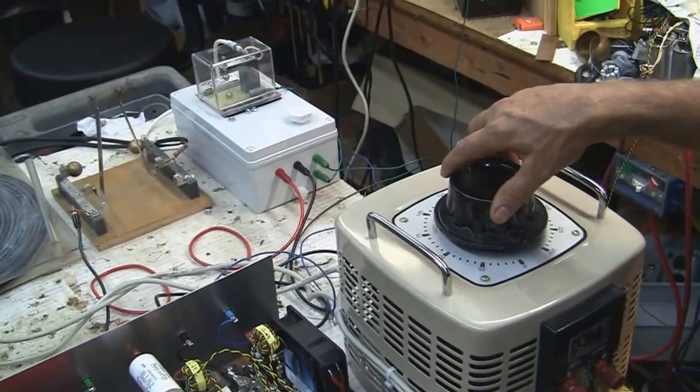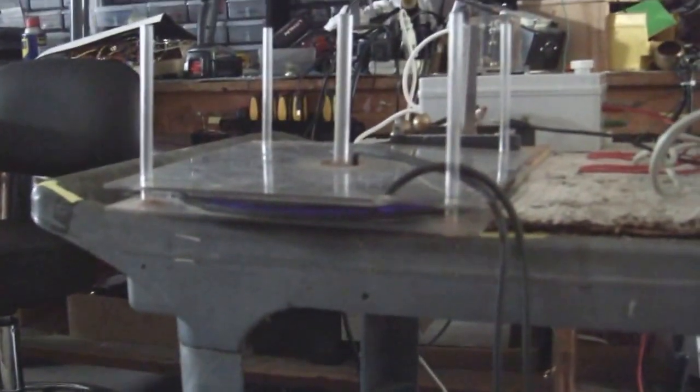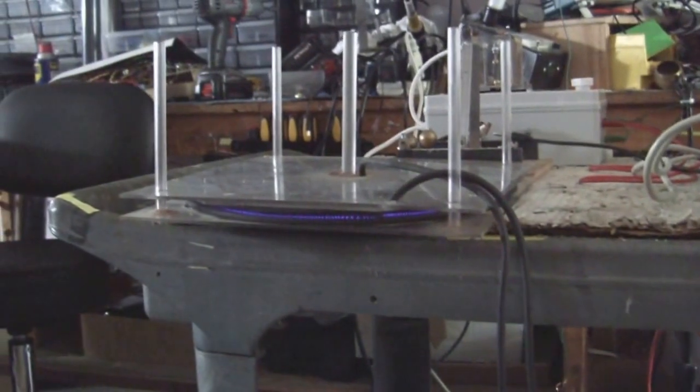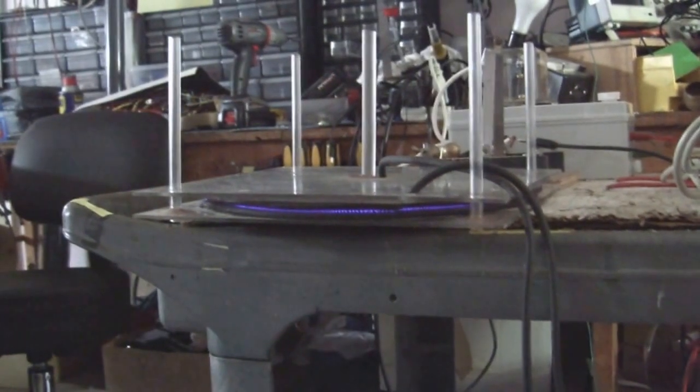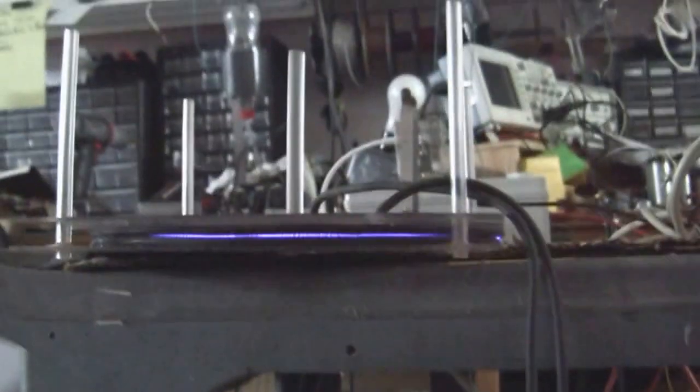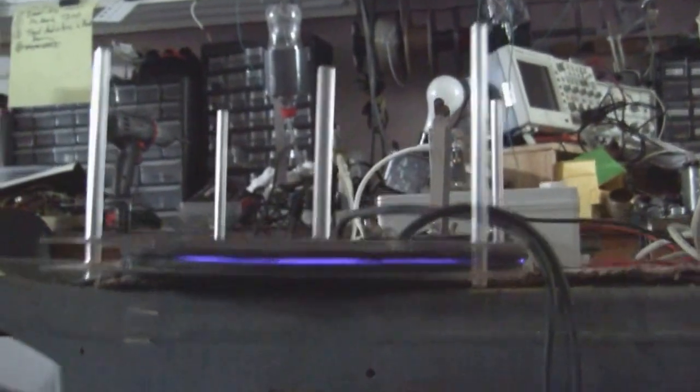Let's turn some lights down. Current is about four amps. You can really see it — it was a little bit stronger before when you had it at a higher duty cycle. You can't see it with your eyes very much but it shows up on the screen. Down here it looks like a stove burner. Right in between those two plates there's a lot of corona.